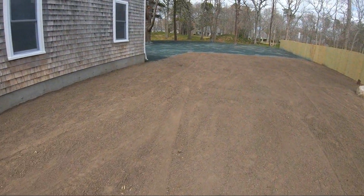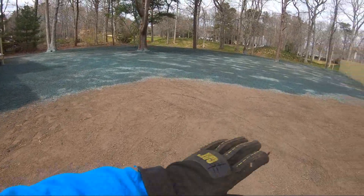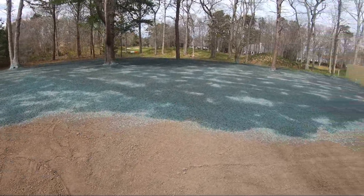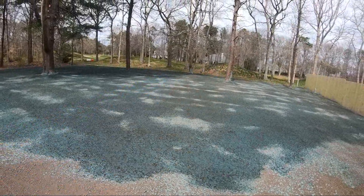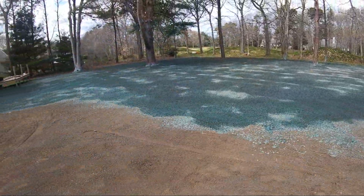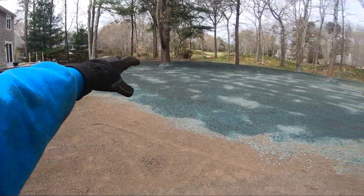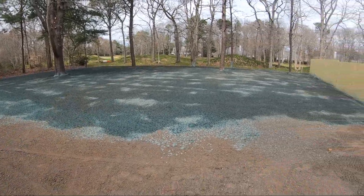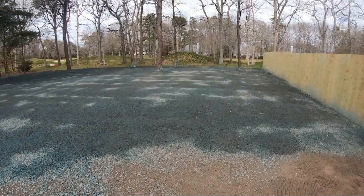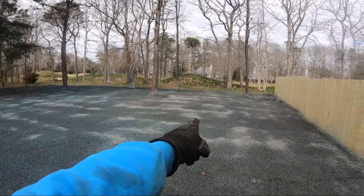This job originally another contractor did it, and we got hired to spread topsoil on existing grade. I did fix the grade a little bit — it was really bad in a couple of spots — but when someone else clears around trees you're kind of stuck with the grade because it goes up towards the golf course. Ideally when you grade, you'd like the whole yard to pitch off towards the woods so vegetation can absorb water, but unfortunately this lot pitches back. There's a dead pine left over there — I'm not sure why they left it.